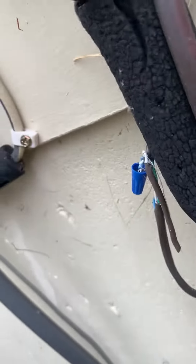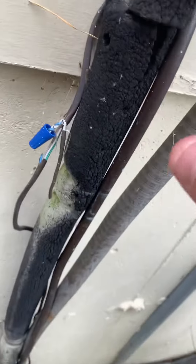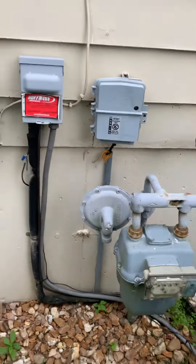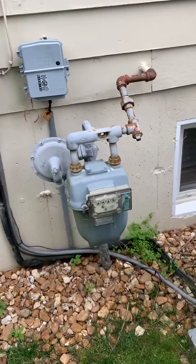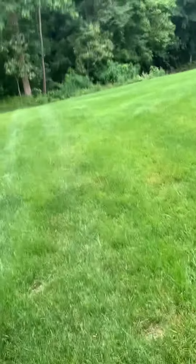It's coming through the hole here — if we can get that slack and stub it into the disconnect box, then come back out. We'll add a little bit of new wire there and that's it. There's actually a walkout right here so we can come around that way.